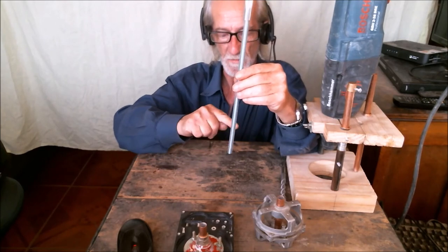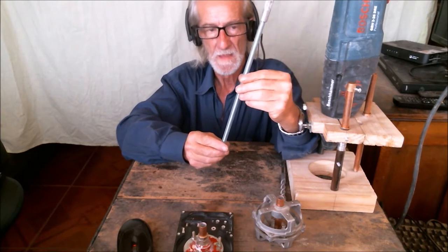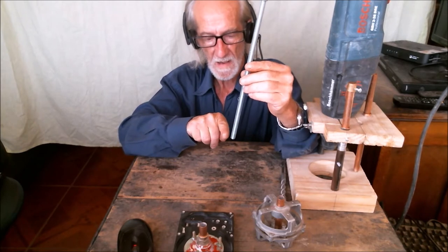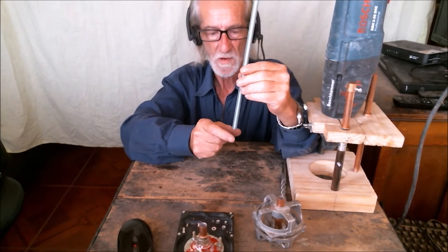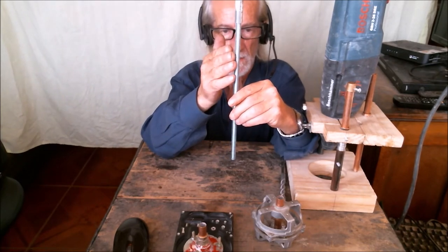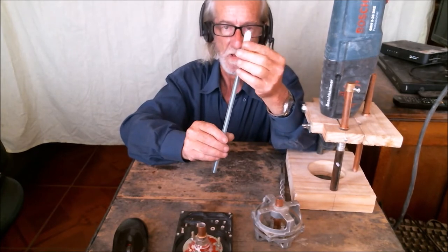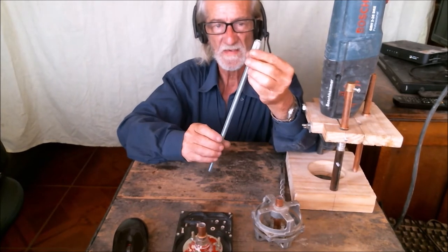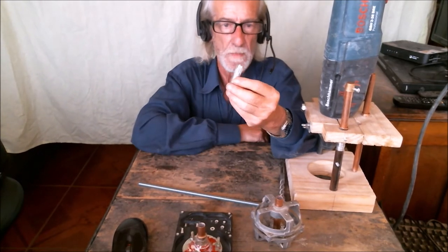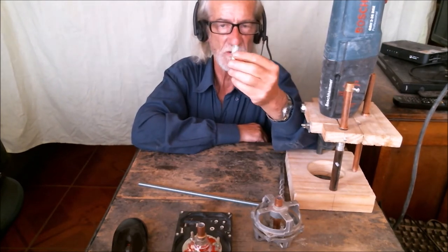And it's here at the bottom of the rod where I have to hang a steel channel. And if the end of the rod is deviated too far out, I won't be able to secure the channel without beating the rod to get it into the vertical position. So, I have to try to get these anchors as straight as possible in the ceiling. Doing this just with a hammer drill on its own, it typically ends up twisted in any plane, and that is not convenient.